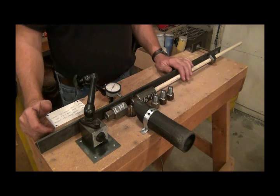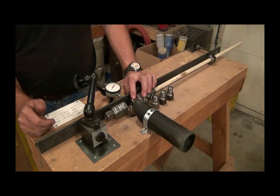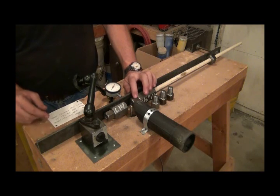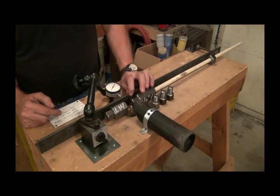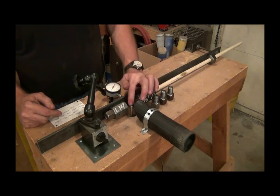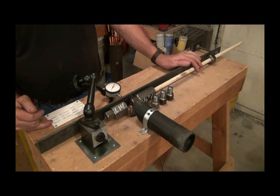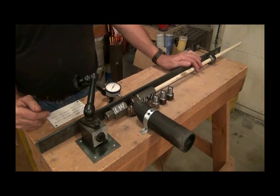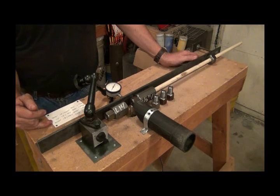Because it's such a minute adjustment. To go from a 23/64 diameter shaft to an 11/32 diameter shaft, the total diameter change is .0156. But you only move your shaft over into the cutter half that distance because you're cutting all the way around the shaft. So I would have to be able to move this thing 7.8 thousandths of an inch to reduce it to that next diameter of shaft from 23/64 to 11/32. And I'm trying to be able to fine-tune the shafts that I'm making the spine on them to match my bow.